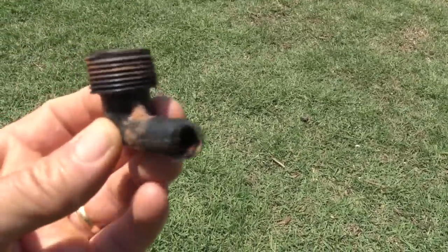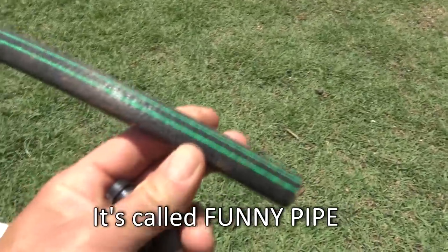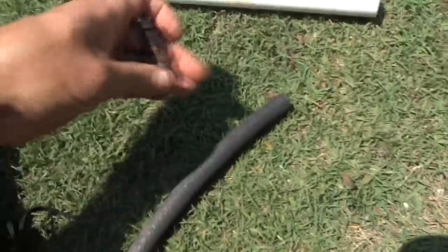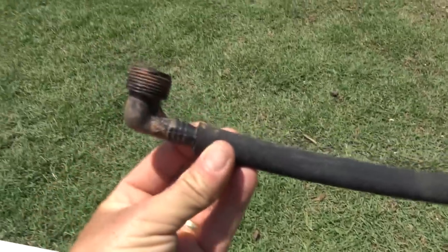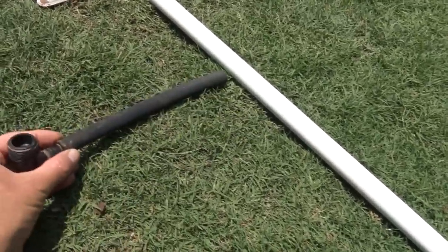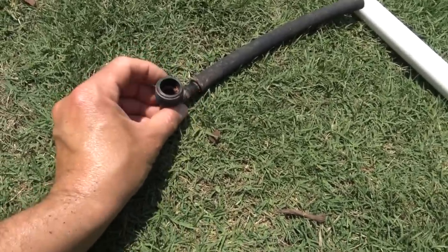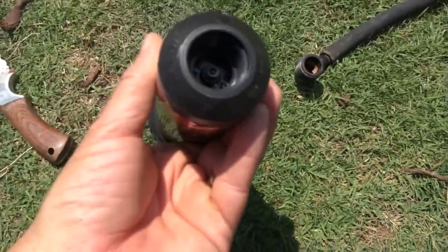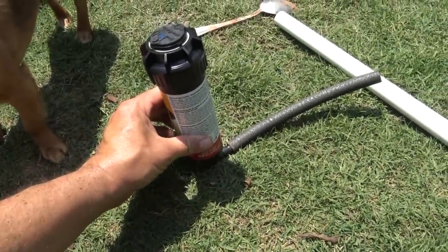These little junctions right here are for your funny hose or flexible irrigation hose — they call it funny pipe. That's where these little things clamp on to. When it's pushed all the way in, that's what it looks like. So essentially you have a flexible irrigation hose coming off PVC to this little head here. What screws onto here? Very simply, what's on the bottom of your sprinkler head? Guess what screws into that — this screws into that. And so basically that's all you have.